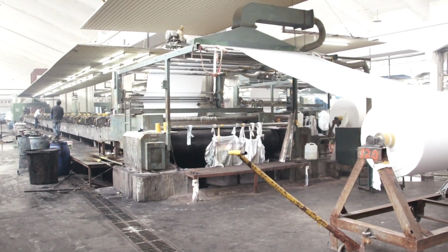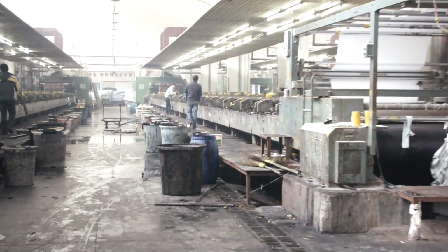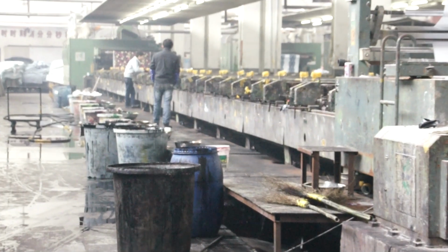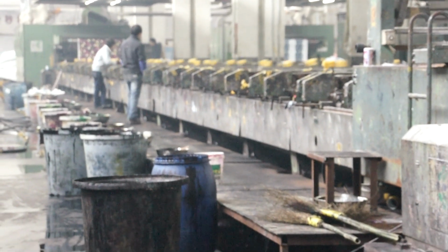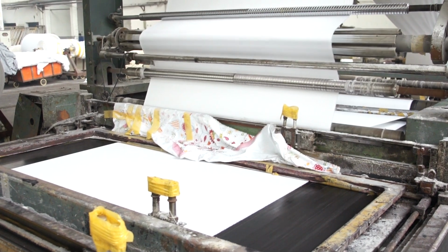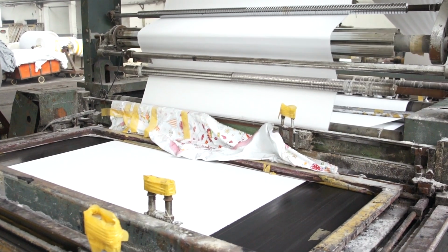Finally, we arrive at the area in the factory where the actual printing takes place. This printer is a flatbed printing machine. The screens are flat rectangles, and they usually measure 24 inches from the top to the bottom and are as wide as the fabric width. The bed of the machine has to be quite long in order to accommodate 10 screens or more. This area is where the PFP fabric is placed on the rubber belt.